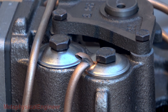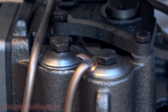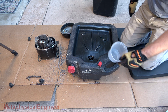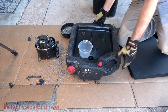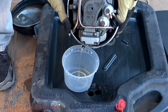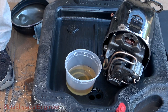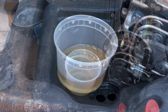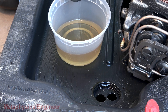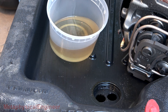That explains why this thing was barely warm to the touch, and running so quietly I had to put my hand on top to feel it was going at all. How about a look at how that oil fared after all of its misadventures? Should be able to pour it out — yeah, that's working. Can let the rest trickle out of the shell. Seems to track with my revised assessment: the failure was that discharge line, not lubrication failure from overheating as I originally suspected.